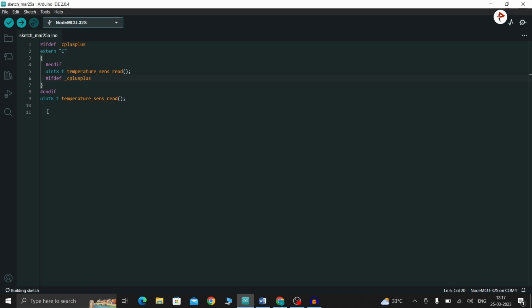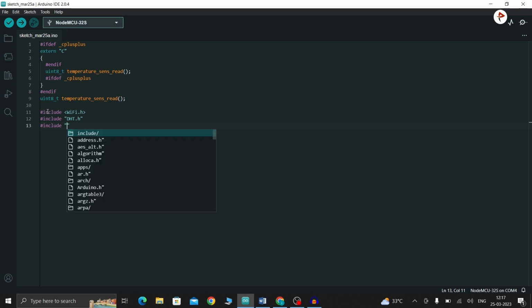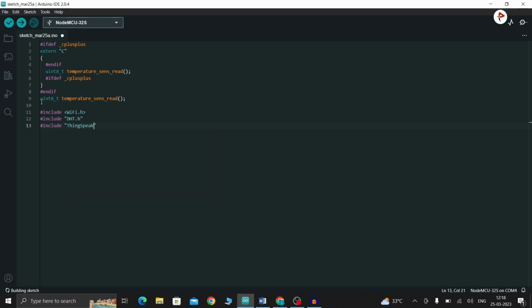So now we are going to add the required header files. In this code we are using three libraries. First one is include WiFi.h library, and then include DHT.h library. We have already discussed how to download and add the DHT library in a previous session, right? So now I am going to include the ThingSpeak library. I will provide you the zip file in the description. Just go and download it. ThingSpeak.h.